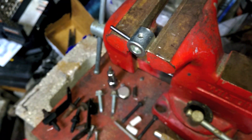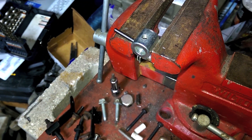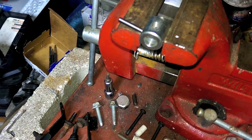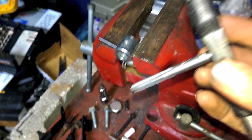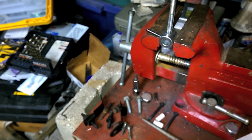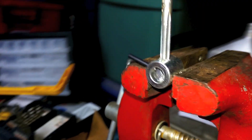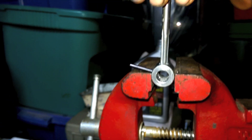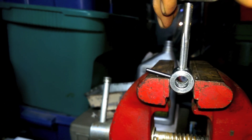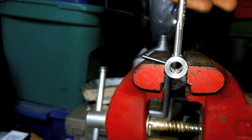Take it out and drill it. In order to use the tap — since we're using a quarter inch set screw — you want to go 1/32 smaller, which is 7/32. That's the hole you drill it to. Then take your tap and your T-handle and put it on there. Give it some pressure, make sure it stays straight, and twist. When it goes in a couple threads it pretty much holds itself. If it starts to bind, just back up a little to break the chip, then keep going.